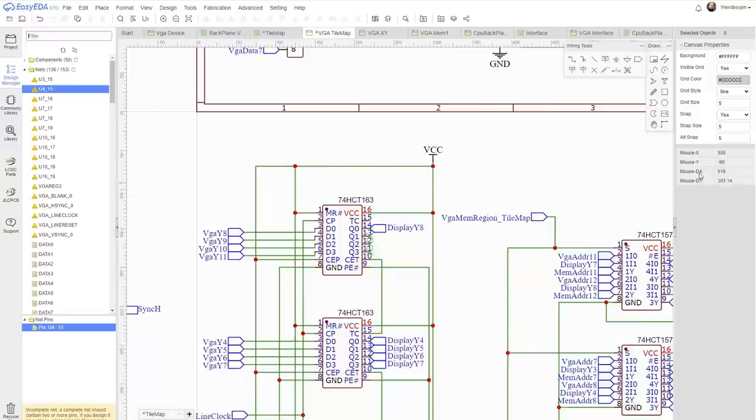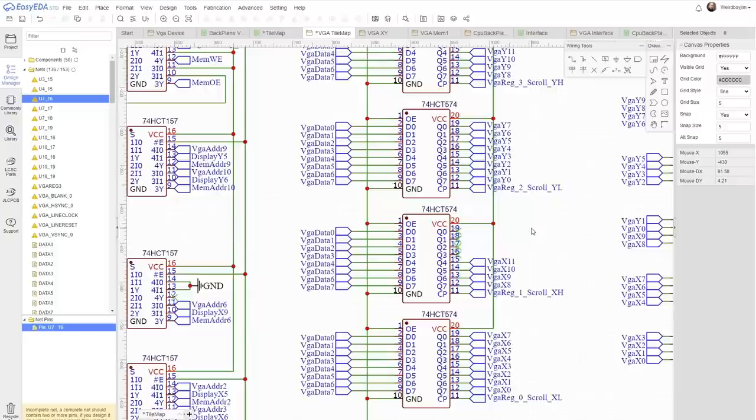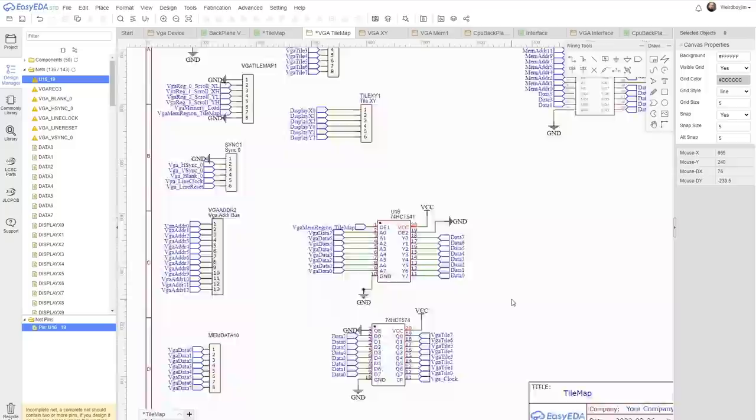Now there are latch chips with a smaller latch count, but I'm not sure I'm bold enough to mix them. Might look into that though, because it'd be nice to save some space for the sprite board. That output enable could go to either of them, and the other one needs to go to ground. Is worth remembering though, because that might help us route around the chip.